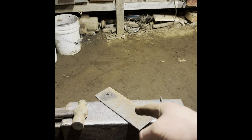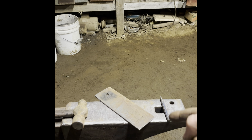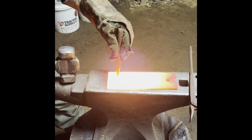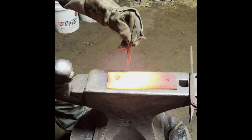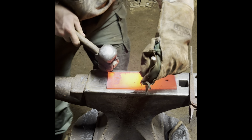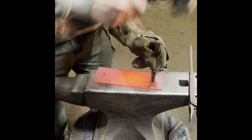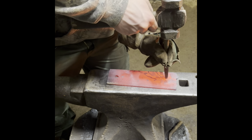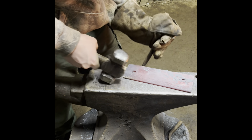So I got the back of the plate drilled out — that's where the strike plate is going to be welded on. And then I got two center punch marks right there and right there, and that's just where the hinge pieces are going to be welded on. So I'm going to go ahead and punch those slots out, making sure they're nice and level and parallel with each other. Punch those down, go right over the hole — just like that, it's out.